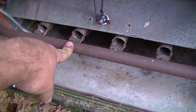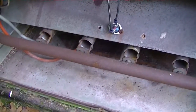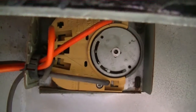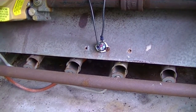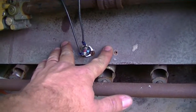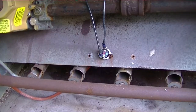Burner number three — right here on the back side we have a hole in the heat exchanger. When the unit starts up it burns gas until the fan control tells it it's time to turn the indoor blower on. When it reaches a certain temperature, the indoor blower comes on and blows back the flame repeatedly — enough times until this eventually trips off or blows the pilot out.